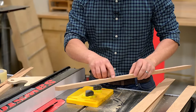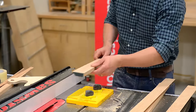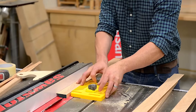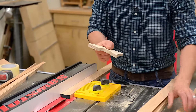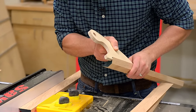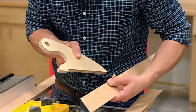I've gone ahead and cut a miter on one side of all four boards. Now I'm going to rotate my board so the mitered side is against the fence and reset my feather board to hold it tight against the fence. When I make this cut, I'll be using a push stick. It's very important that the hook of our push stick is over the center of the board. If it's too close to the miter or too close to the fence, it could cause it to roll as we exit our cut.